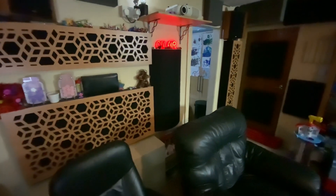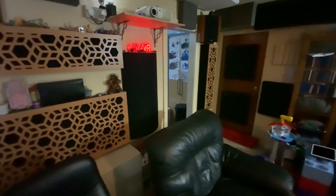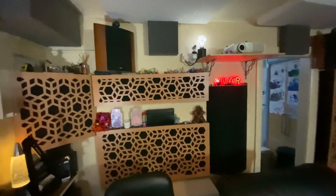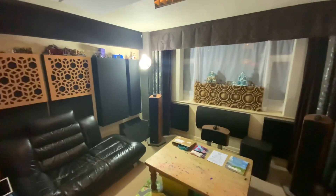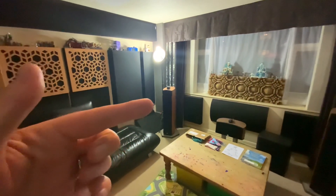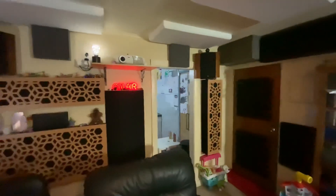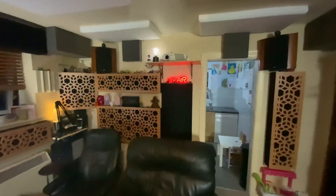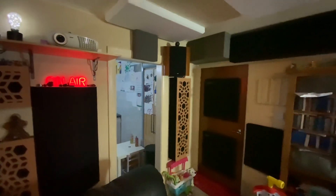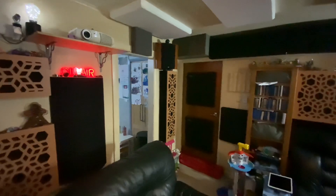So these are thinner panels right by me, just because they felt more comfortable. The one a bit further away is still deep even though it's right behind the door — it kind of stops the door opening, but the speaker did that anyway. Along the top we've got these 30 centimeter pieces — they're off-cuts from the ones in the front corner, custom made to plot the ceiling. The remaining sections went up here to work as first reflection absorbers for my rear speakers.